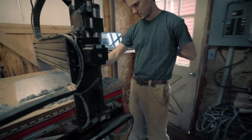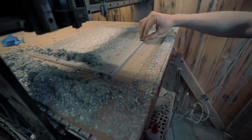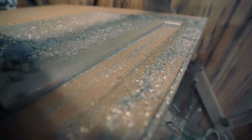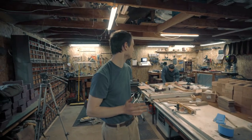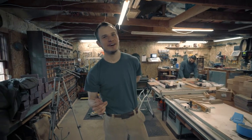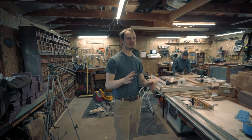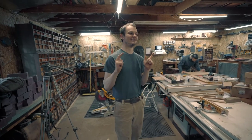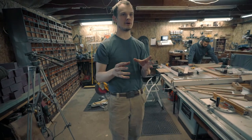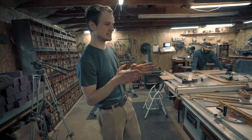So anyway, you can see the quality of cut isn't so spectacular. And we were using an 1/8 inch end mill, so maybe Josh is wondering if we went to... because we're going to be cutting steel. Quarter. Oh, it was a 1/4 inch. Okay, yeah. But eventually we're going to be cutting steel on the CNC router, and maybe if we go to an 1/8 inch end mill, there'll be enough horsepower and rigidity to keep it from chattering too much.